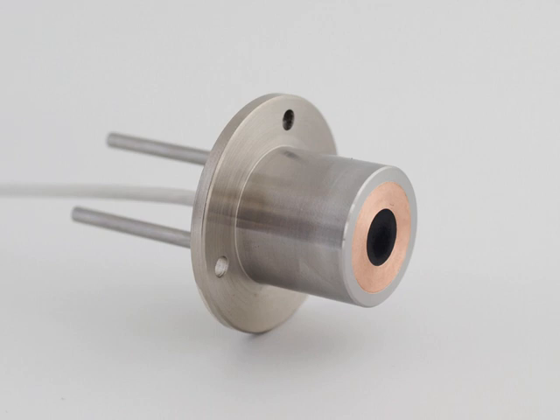In order to attain the proper directional and spectral characteristics, a Gardon gauge's main components are a thermocouple sensor with a black coating. This sensor absorbs all radiation, has a flat spectrum covering the 300 to 50,000 nm range, and has a near-perfect cosine response. The black coating on the thermopile sensor absorbs radiation that is converted to heat. The heat flows through the sensor to the sensor housing and from the housing to the cooling water. The thermopile sensor generates a voltage output signal proportional to the heat flux.